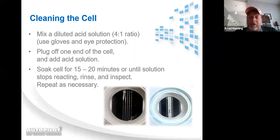So, we talked about checking the cell to see if it's scaled up. We talked about white flakes back to the pool. We talked about if the cell's not scaled up, but you're getting those messages, to check the blades, the far left, the far right. If it's a 2-prong cell, or if it's a 3-prong cell, check the far left, far right, and the middle blade. Because in a 3-prong cell, the PPC4 has 13 blades, and the PPC5 has 15 blades. Once again, you check far left, far right, and the middle on the PPC4 and PPC5.